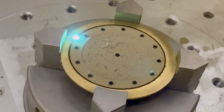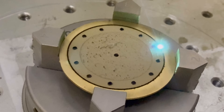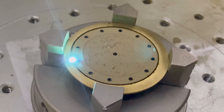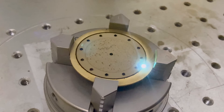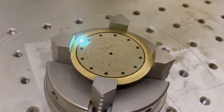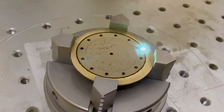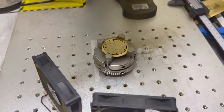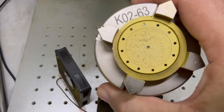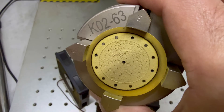The cutting edge I do very low and very slow — typically 75 or 80 percent power. I try to keep my laser at 75 percent or less because otherwise the components inside get pretty hot, which can actually cause the laser to fail sooner. In this case I did about 40 rotations — maybe 20, I can't remember — but the main thing is you just want it to be scored on the back.